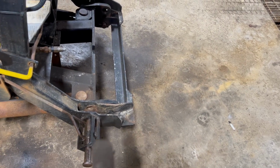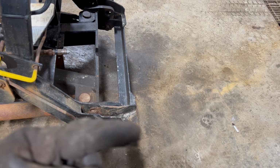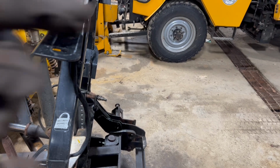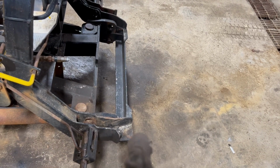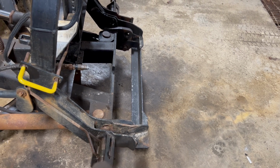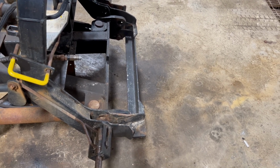So what happens is, when you put this on the truck, you've got little ramps in the push mounts there. So this goes in up to that ramp and kind of shoves up on there, and then you push back on the headgear, and it pries against that like a lever and lifts this up to put this pin in, and then that goes through the hole in the front of the push plate there.